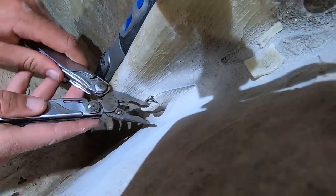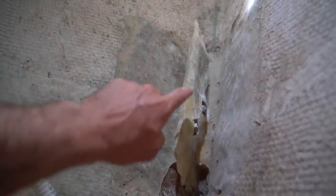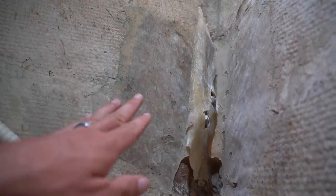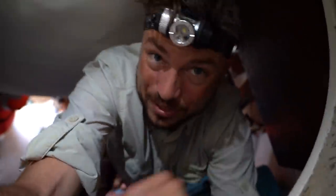That went pretty well. I was able to expose the nuts on this side. I don't want to remove the bolts right now — I just want to keep everything in place for our trip over to the boatyard. I would not recommend this kind of setup because you want to be able to visually see and inspect your chain plates. We had no idea if this was leaking — it was sealed — and when I cut into this bolt head there was some water trapped inside, so it's definitely been leaking and saltwater has just been sitting in there against the stainless, which is just terrible. But now that these are open I can at least know if it's leaking. Bobstay chain plate is ready to be pulled.